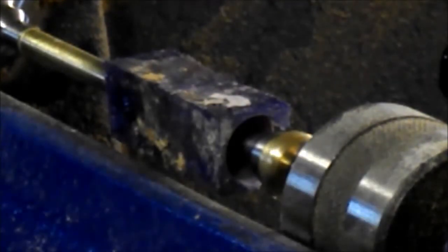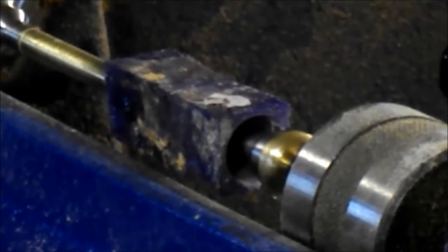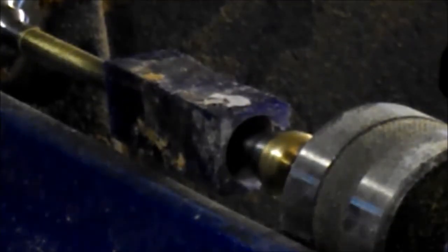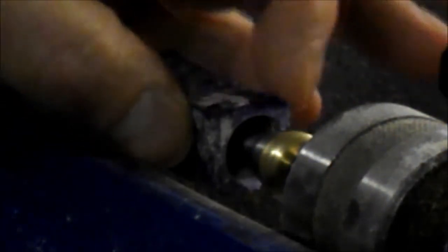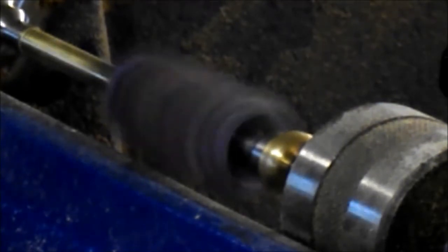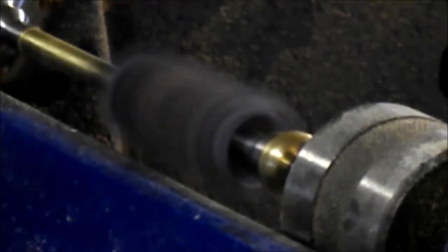Just give it a quick sharpen. So, I've got my lathe set on the highest speed that this one will go to, which is 2000 RPM. It'd be nice if I could get it a bit faster than that really, but it's adequate. I manage to cope okay with it. Right, so on with the lathe. I've got my roughing gouge here.